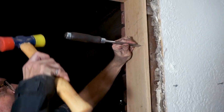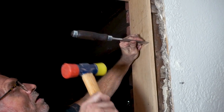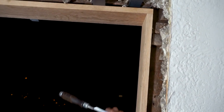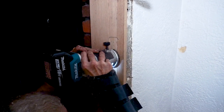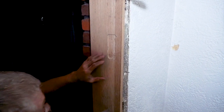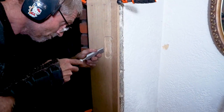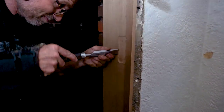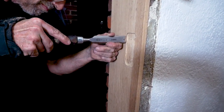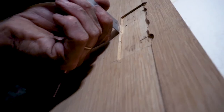I bought commercial grade hinges because the door is so heavy, and I didn't realize it when I bought them, but it turns out that commercial grade hinges, by definition, do not have pins that remove. So that meant that I had to line the door up against the door jamb with the hinges on the door. The benefit of that is that everything's going to line up. The difficulty was that the door was so heavy that it took three of us to hold it in place to mark the locations of the hinges.